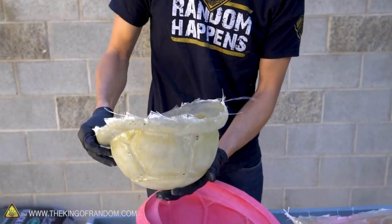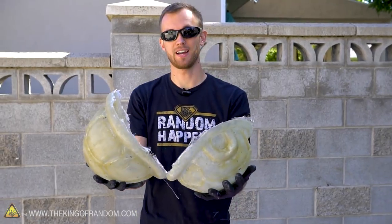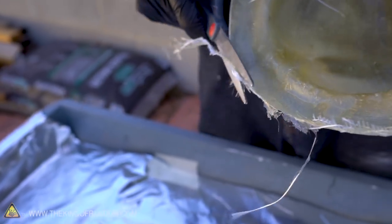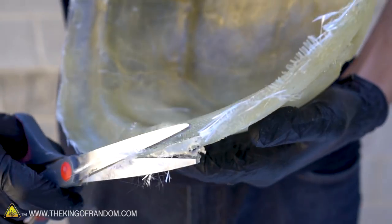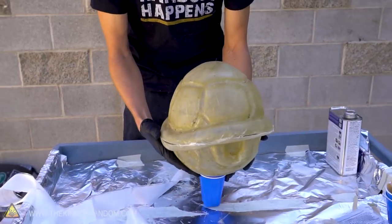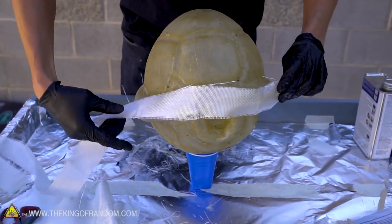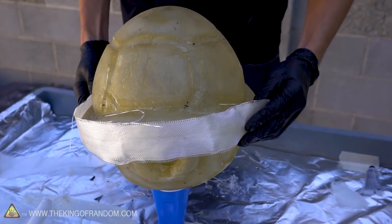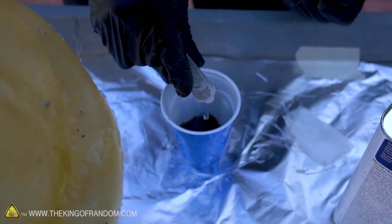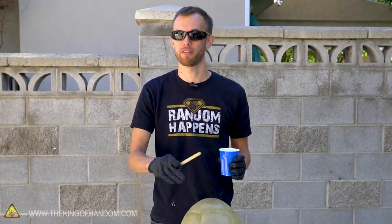There's the top half — we have the two halves of our shell. What we're going to do is line them up and use a strip of fiberglass all the way around to secure them together. Before we attach the two sides, let's trim the excess fiberglass that was sticking up over the edge of the mold into shorter, more manageable pieces. This application of fiberglass is basically the same as what we did before inside the mold: we'll put a thin layer of resin on, then attach the fiberglass cloth to that, and then use a thicker layer of resin to glue it all down.